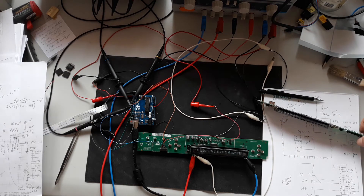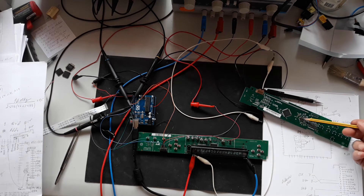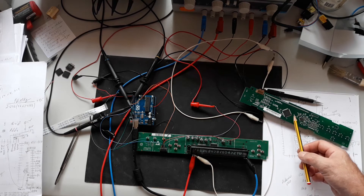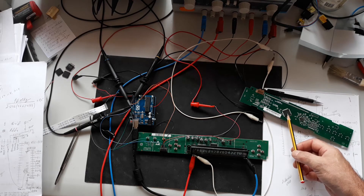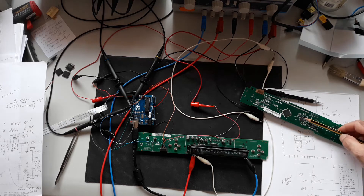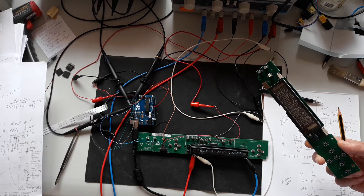The first thing I need to do to reuse this board is remove the ATmega88, which is the processor controlling the old board, and connect to the PT6302. After removing the processor, I connect three wires from my new processor directly to the corresponding points on this board.